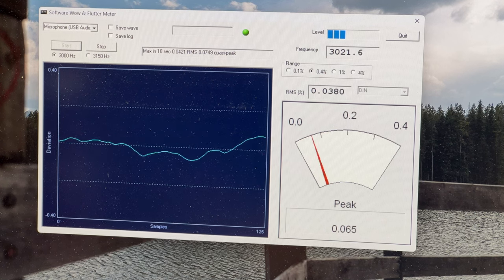Anyway, before we get back in there, I've got a whole list of the audio chain capacitors laid out here, I hope. As you can see, there's four down here that are labeled UKZ. That's where I'm going to use the really fancy caps. There's four of them, and only four in this deck that it turns out the UKZ parts are applicable. But all four of them are in the recording chain directly before the record head.